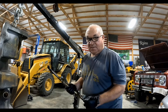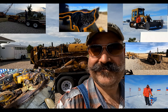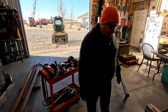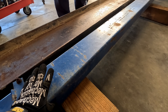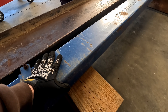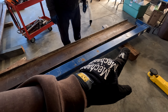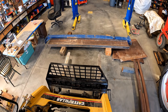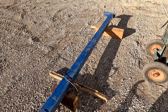We've sourced all the parts we're going to need for this gantry crane, but we need to make a few. What do we need to do first? Well, I think you always start with the foundation, which is the base that the casters will be on, and build up from there. We're going to use this 4x6 box steel — it's actually a toolbar for a sprayer for ripper shanks — so that should be heavy enough. We're going to cut it in half, cut these ends off, and make our A-frame up from there. This thing's going to be super overbuilt.